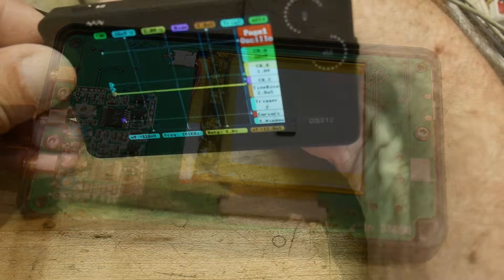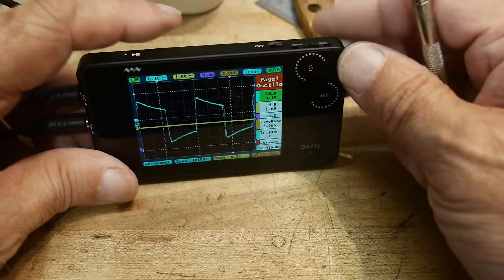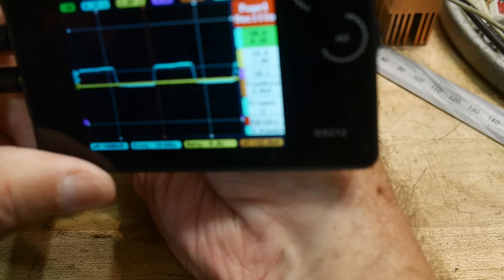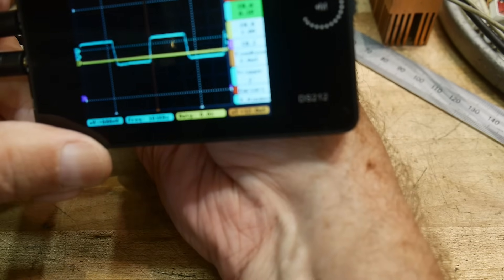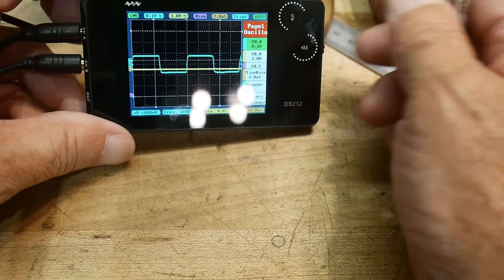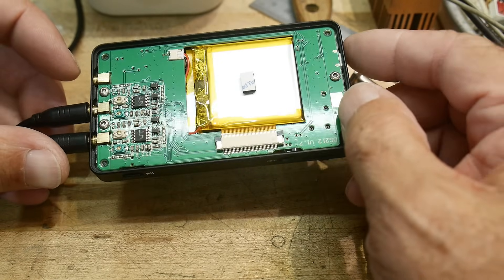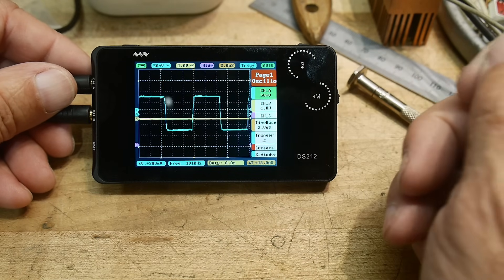Anyway, there's the battery. I accidentally tapped the wheel when I went to the other side. Maybe this is amplitude gain or something. It looks like you can tweak it in because that looks like a fine signal to me now. So it is doable. I don't really see the instructions in the manual on actually doing this, but it does have the compensation right there and you can get a nice square waveform.